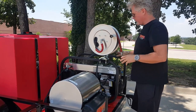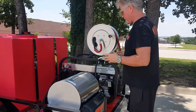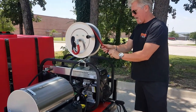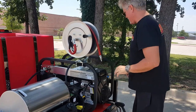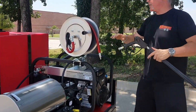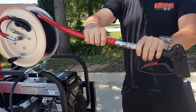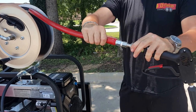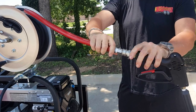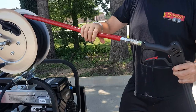This rig, when it's running, it's only got one engine running, and that's all you need. So I'm going to fire it up here and show you how to run it. The fact that everything is back here makes it really easy to operate and get started. First thing you're going to do is connect your high pressure line. Very important that you get this all the way snapped down, because if you don't, you're going to start the gun, start the pressure washer, and the gun's going to blow off and you're going to lose that o-ring. So make sure this is all the way down and secure.